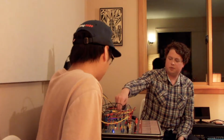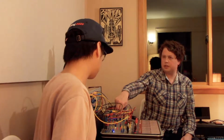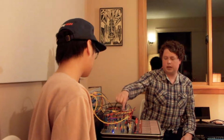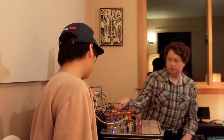And then you get to the oscillator. If you're familiar with a Make Noise DPO, it's kind of the same setup. There's a modulation oscillator and a complex oscillator. So the oscillator on the left can modulate the one on the right. And then these are both routed to the 2 low-pass inputs. That's the one semi-modular part about this: it is internally routed, so you don't have to patch the signal. Right, because it's already normalled under the hood. Yeah, exactly. And then on out through a mixer.